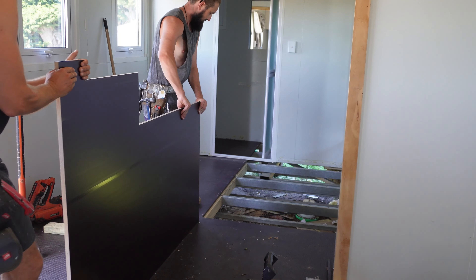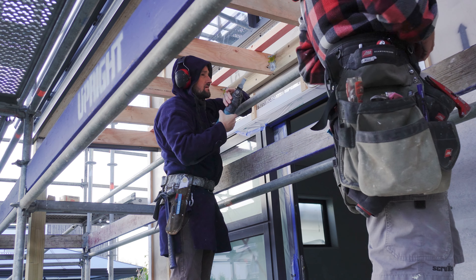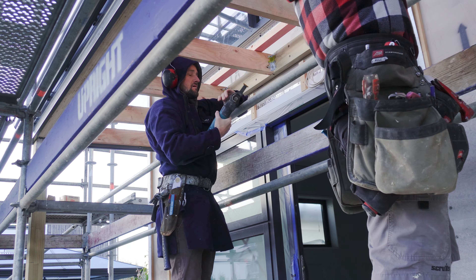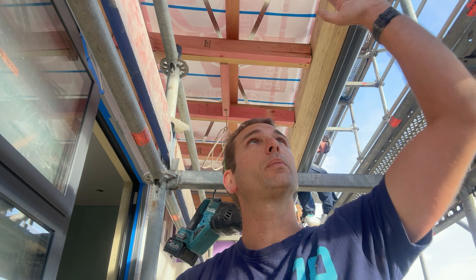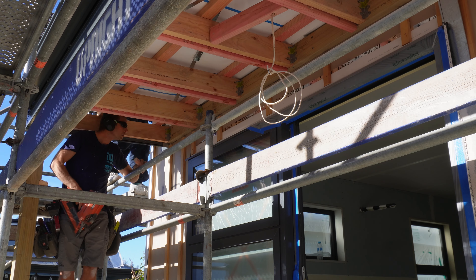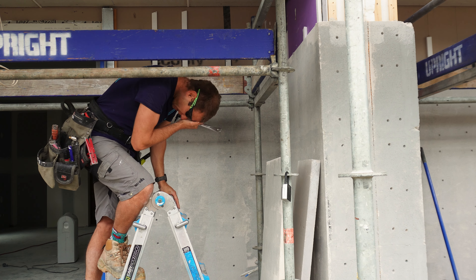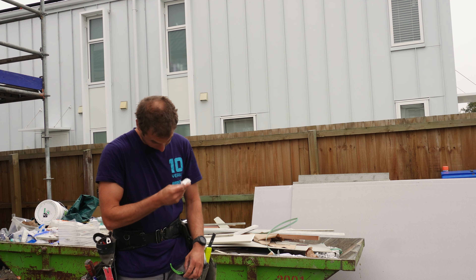Good morning — exciting news, James has started back. If you don't know who James is, he last appeared about three months ago in my video on the 125 millimeter saw review. He injured himself at the end of that video and has been off work ever since, but this week he's started back part time — half days, three days a week. We've started framing the soffit. Because the beam is 150 and the stringer is 140, we need to frame down, so I started sistering joists. We then realized the fascia at the edge is lower, so I've got to cut them off and adjust them, and we'll need to put blocks along the edge as well.